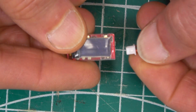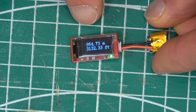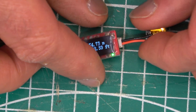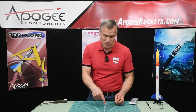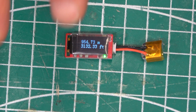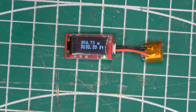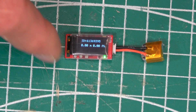To turn it off, just unplug it. When you turn it back on again by plugging it back in, it will again blink out the last altitude. If you disconnect the battery any time during that flashing period it will save it in the device. It only zeroes after it goes through 10 seconds of flashing — blinking out the altitude of the last flight 10 times, once a second. Once it's done it zeroes it out and it's ready to launch.